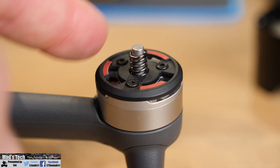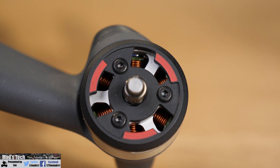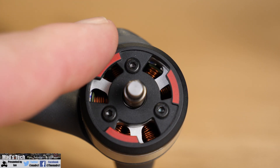Moving up to the motors — fairly simple and easy to check. Make sure your motors are rotating smoothly. The motors on the FPV drone do cog — you can feel the magnet as you rotate — that is perfectly normal. Compare all four: do they all feel the same? Are there any unexpected noises like scraping or something moving? Look down inside the top of the motor and check for debris. Use an air duster to blow it out, or a vacuum to suck anything out. Even the smallest piece of grit can jam the motor in flight and cause you to lose your drone.